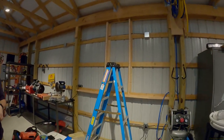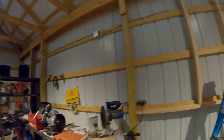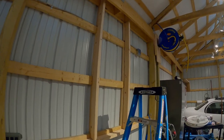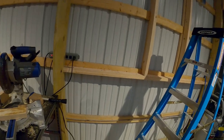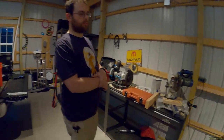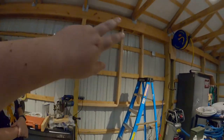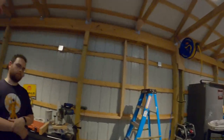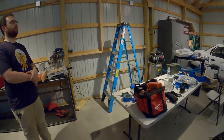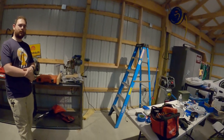No, I didn't. Okay, so here's what happened today. 30% of this install is done. We reinforced the wall and mounted it on the other side. You saw that. We'll continue this video at some point. We've got to do the electrical run from there to these two units, and then mount the inside parts up to that. Then we've got a vacuum pump, and then we're done. We have to do the line set connection between the inside units and outside. I don't want to do that. All right, anyway, we'll be right back.